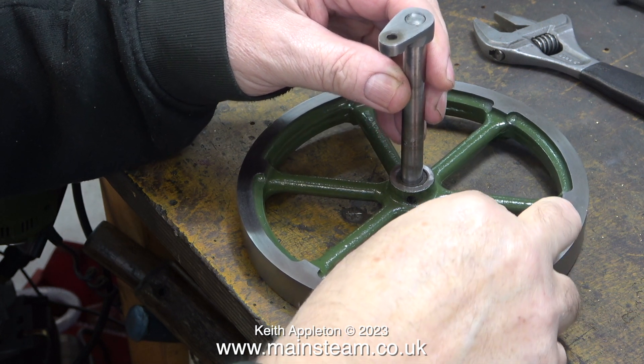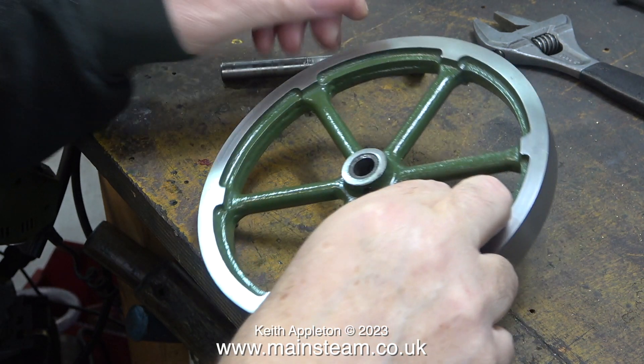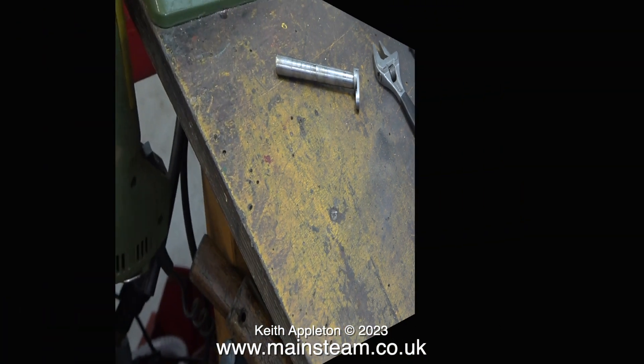In this clip you can see how the original crankshaft was a very sloppy fit in the hole in the flywheel. What is the reason for this? It's clear to see that this has been bushed, and the internal diameter of the bush is nowhere near what it should be. If you're not used to working with engineering components, you may be confused when you come up against the tight tolerances of a crankshaft to a flywheel. I really do think this is what happened: it looks to me like the builder drilled out the hole with an oversized drill, realised the mistake, then drilled it bigger to fit a sleeve. Unfortunately, the bush that was fitted was also too big. I cannot live with this, so I'm going to put it right.